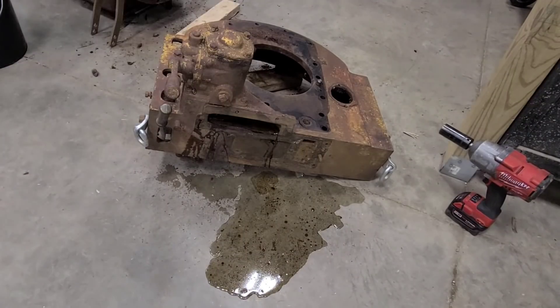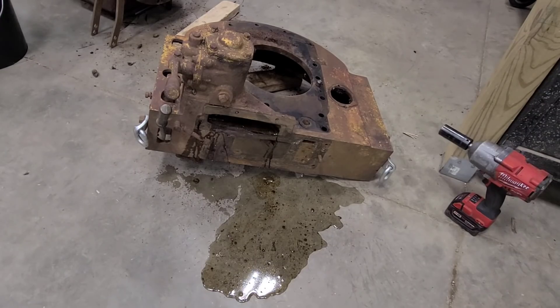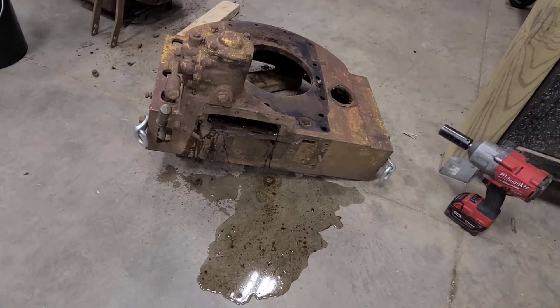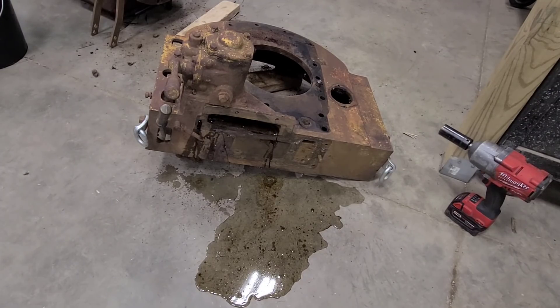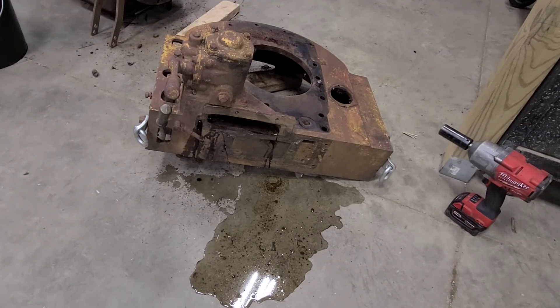We found the water that has been living in that pinion under the starting motor. Hopefully it didn't freeze and crack anything. A lot of these parts that do carry coolant, I'm going to send them off to the machine shop — just have them magna flux them. I would hate to get something all cleaned up, painted, and then find out after everything's back together that it leaks. I know this tractor had freeze damage, so just to prevent any of those situations, I'm going to spend the money and have them magna flux it, because that water there obviously was frozen this last winter.